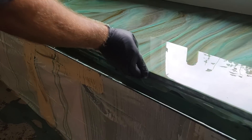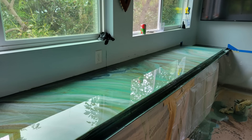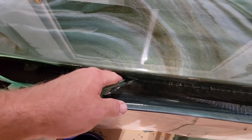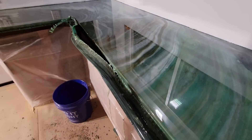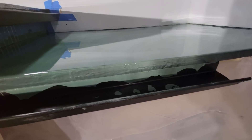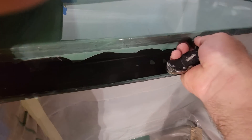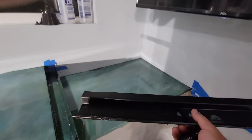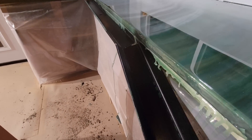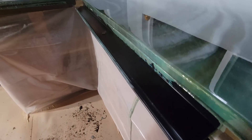About three hours after pouring, I came back, removed the tape, and used a gloved hand to smooth out those edges. Then I let it sit overnight. Nothing sticks in these gutters — look at that. We took out all the screws; you're going to score between the gutter and the edge. Pull them apart — there's your connector — and then clean under that bottom edge. Reusable gutters.